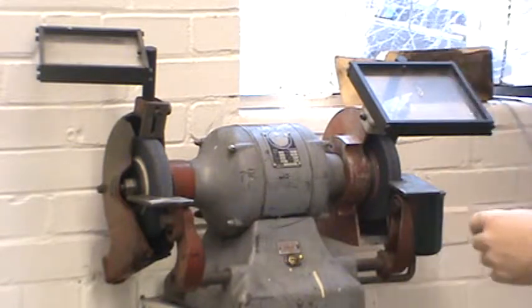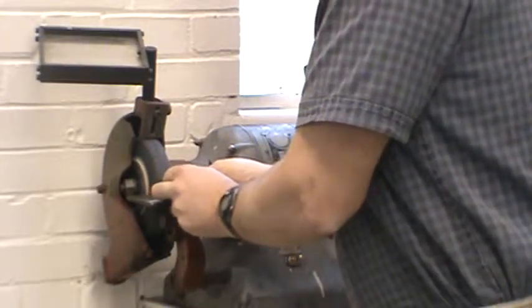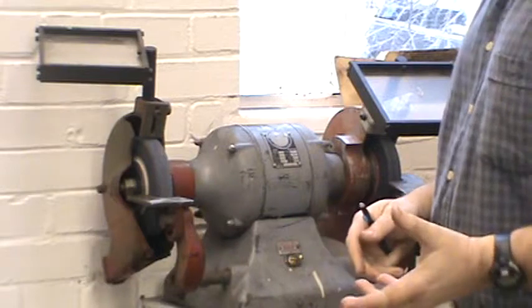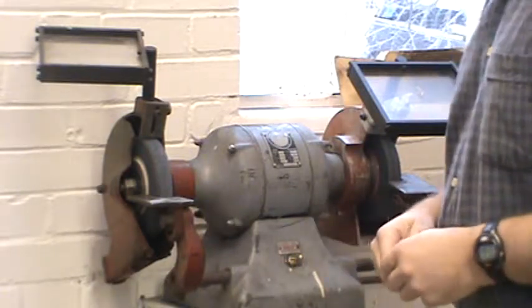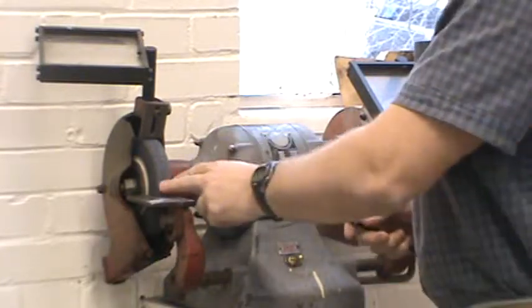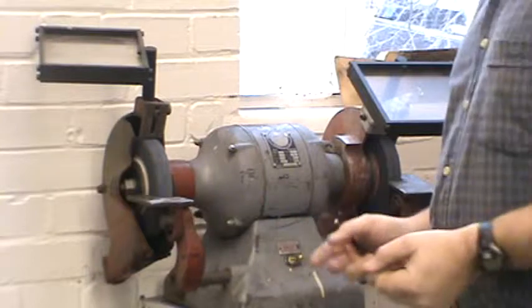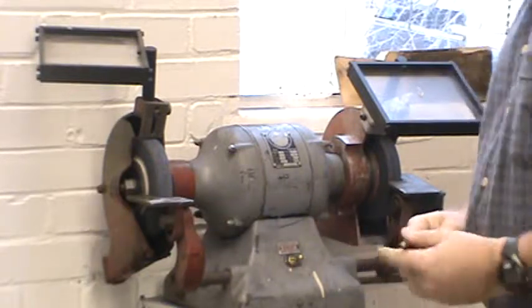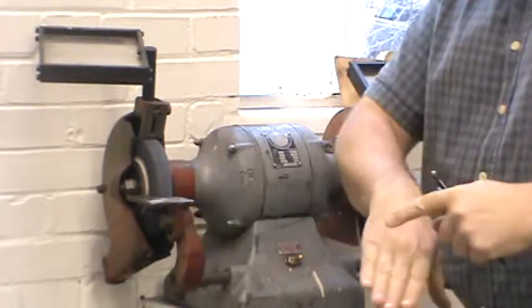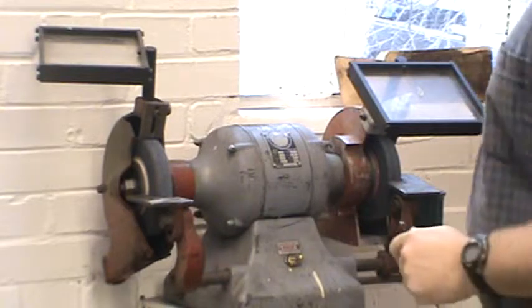Always give this machine your undivided attention. It's okay to have your fingers within an eighth of an inch of the wheel as long as you're totally focused. Unlike some other machines where injuries can sometimes be repaired, when you get hurt on a grinder, typically your finger or whatever is just turned to dust — there's nothing you can do to fix it. A student once wiped his hand across a surface grinder and cut right through the flesh on all four fingers, with tendons visible underneath.